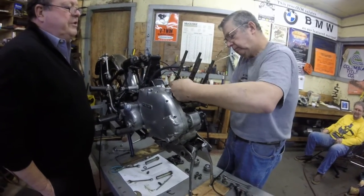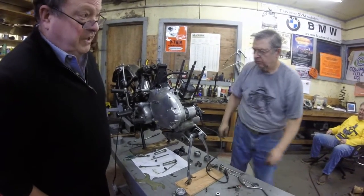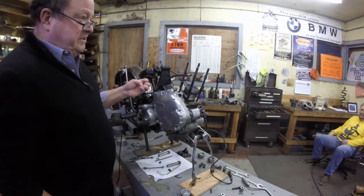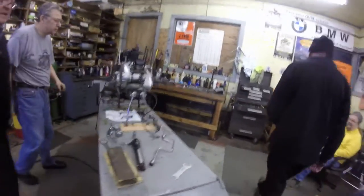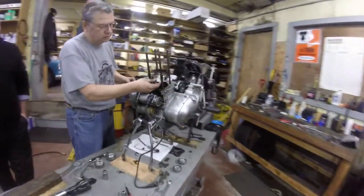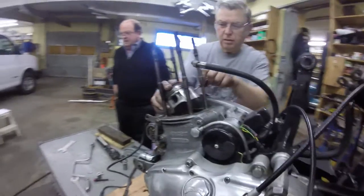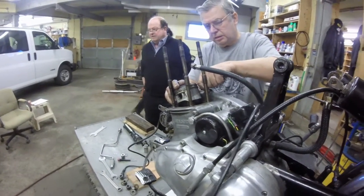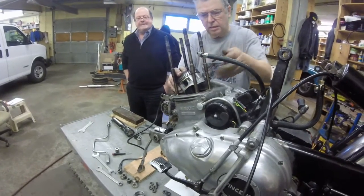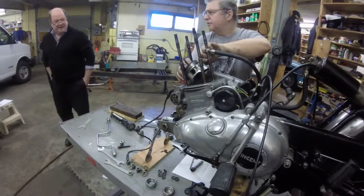That's right. So how old is this piston then? Not old at all. So is this a low expansion piston? Yeah. So what kind of clearance was it set up at? 5.5, something like that. But the thing was, I couldn't get a good machine shop. I'll take my stuff now to where John takes his. That was the trick then. They've done them before and know what they're doing. But I just walked into the machine shop. Because 5 is pretty good clearance. Five is way too much.